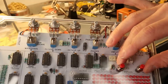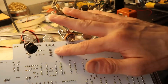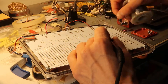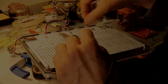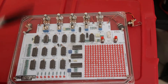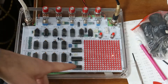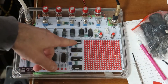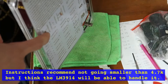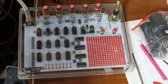I've got the pots and the switches somewhat screwed in here, and now everything's aligned the way it finally will be. So I'm going to go ahead and finish soldering these parts in that I only soldered in one spot before. Go ahead and mark where you want your jacks to be, and mark where the circuit board holes go. Here we go with the test. The LEDs I thought weren't quite bright enough, so I actually bypassed the 4.7K resistors with an extra 2.4K resistor. I did it on the back because it's easier to modify later. Let's see if this thing works - I've just got my guitar hooked up to it.